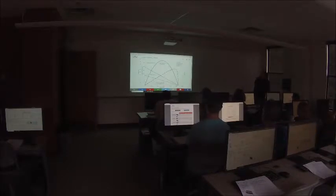Now, this is really where the freeload speed comes from, this linear relation between torque and speed. So as you can imagine, when the motor starts turning, there's a lot of torque. And when you apply torque to a rotating mass, in the case of our example, the rotor of the motor, the shaft of the motor, it weighs something, right? It takes torque to accelerate that and to spin it up. So if you apply torque to a mass that can rotate, it will start to rotate, and it will accelerate proportionally to how much torque you put on it, right? So if you put twice as much torque, it's going to accelerate angularly twice as fast, okay?